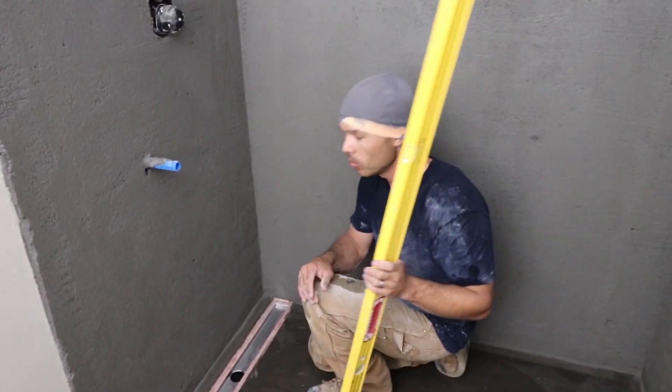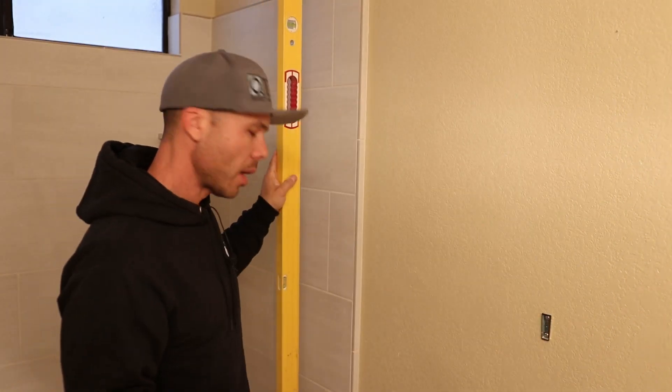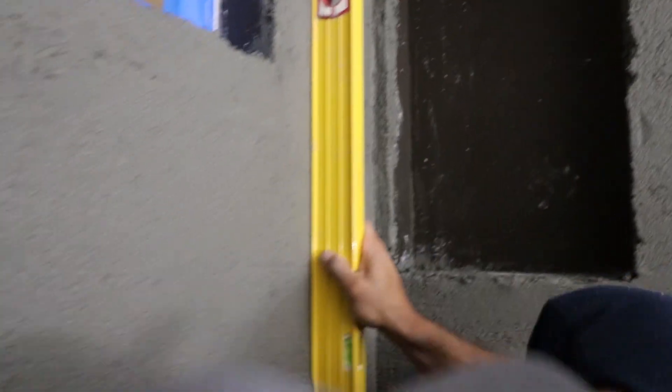When we float our wall, I get a lot of questions about why we even float walls — that's one of the biggest questions I get. You guys say it's overkill, you've never heard of it. It's a great method, and I've taught this method — I'll put a link up so you can see how we float walls. What it allows us to do is get a perfectly flat, straight, plumb, and strong substrate when it's done right. Let me show you with the level. When I put my level on these walls, it's dead nuts. Not only does it look better, but all of your cuts on your inside corners are going to be the same if your wall is plumb. It just looks great.